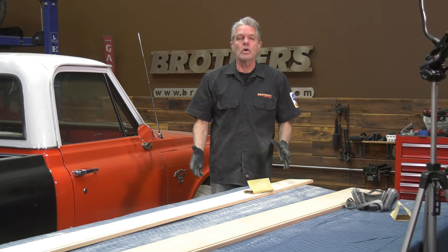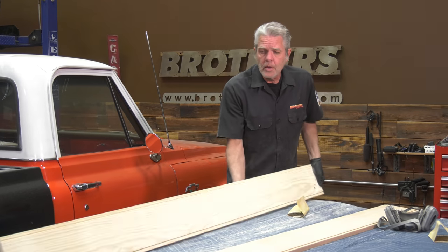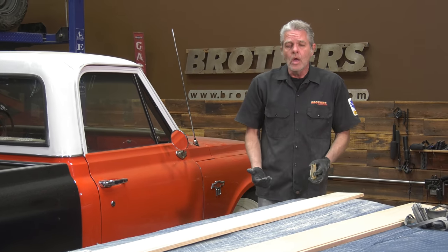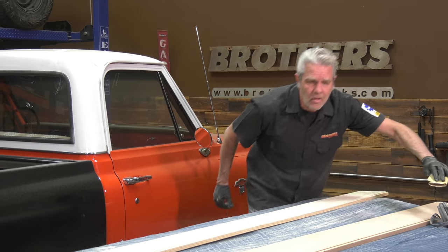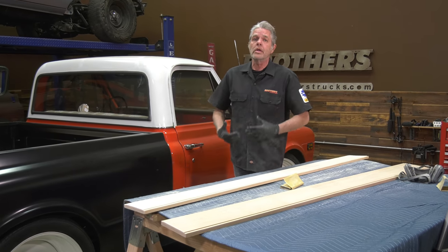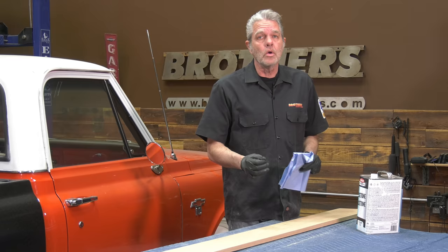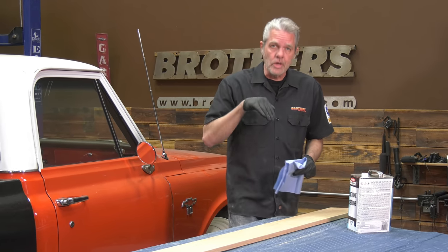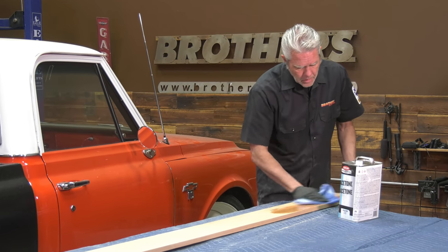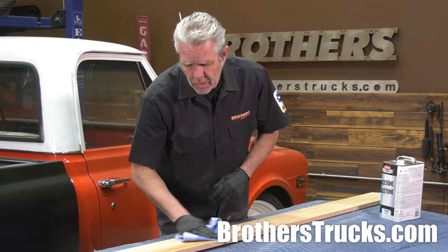Set yourself up a comfortable workstation - not too high, not too low. Get a cheap blanket like this because you are going to be flipping the boards over to sand the backs, and you want to make sure they don't get scratched on their nice sides. Keep the boards to the edge and don't put all eight boards out at once - you are going to kill your back. This project does take a little bit of time, so save your body. If you notice dirt or possibly some grease on your wood, don't sand it out because it might grind it in. Use a solvent like acetone or wax and grease remover to clean it off first. You must have a clean surface or the stain won't stick and the clear coat won't stick.